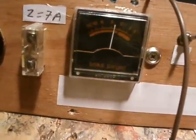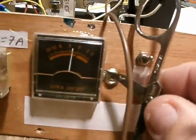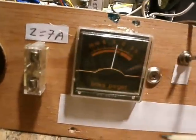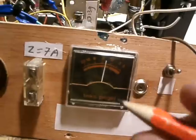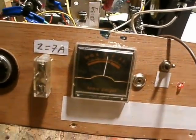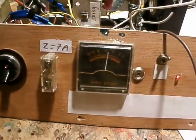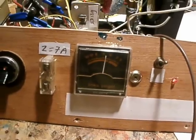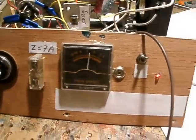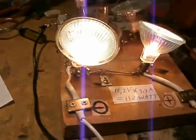I'm going to cut this plastic panel off and glue a piece of paper at the back side, and then I'm going to calibrate it and compare the values to the calibrated meter. And then I've made a homebrew ammeter. I've done that many times and it's very easy.